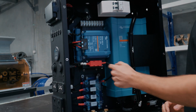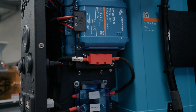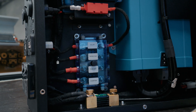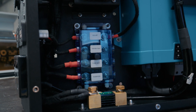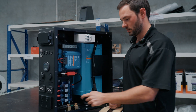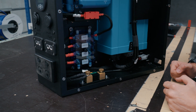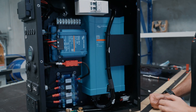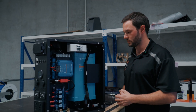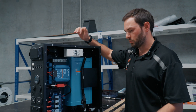Just below that we've got our midi fuse — this is for the 50-amp output Anderson plug, and it's all labeled for you so you know what it all is. Just below that we have our four-way mega fuse holder, which fuses all the other gear like the solar, the DCDC, the inverter — it's all labeled again. Just below that we've got the Smart Shunt itself, so that's all pre-wired for you — you just have to connect your negative onto your battery. Just to the side we've got the MultiPlus — this is a 1200 VA MultiPlus, so it's an inverter as well as an AC charger, giving you 50 amps of AC charging as well as a 1200 VA inverter. It's nice and compact and gives you a lot of power as well as charging.